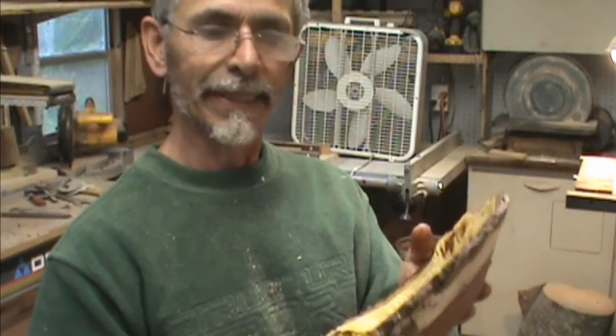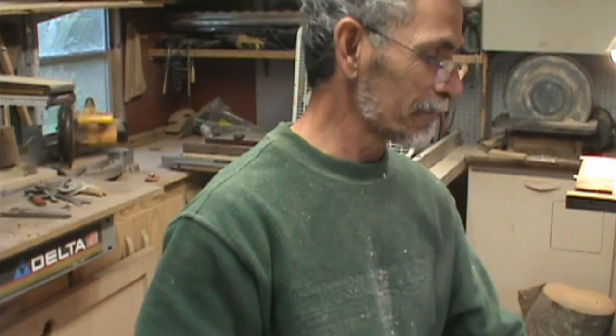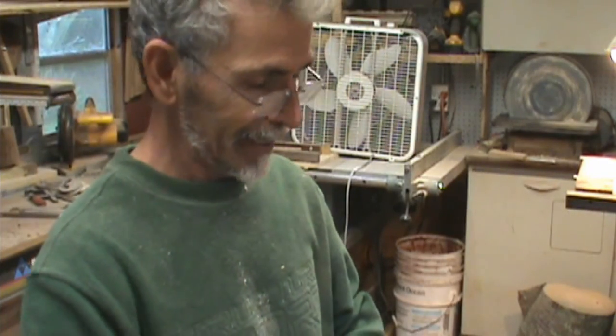Here's the last of the burl. I thought it was going to be more like a platter, but it's actually a little bit of a bowl. Nothing too fancy on the bottom. The crack on the cherry kind of bothers me — it's not the type of piece that should have cracks, and it tells me that later on I probably want to do something different with this. But for now, this was today. I worked on my lathe, got my variable speed working with the external controller. I got the forward to work — that's as much as I'm going to get. Waiting on the RPM pickup. The lathe is very nice and I'm glad I've done all the things I've done to it recently. It just made it that much better.